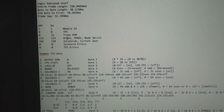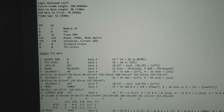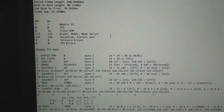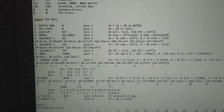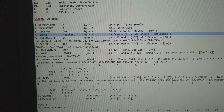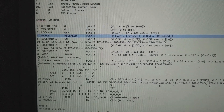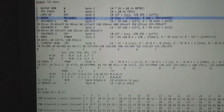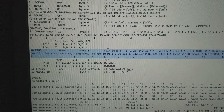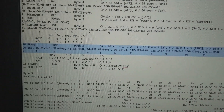For the brake switch: if the number is even, it equals pressed; if it's odd, it equals released. Not too bad. For the PRND switch, first we divide by 16. So 0 to 15 is a question mark, 16 to 31 is 1 or 2, 32 to 47 is 3, and so on. If we take 15 and divide by 16, that's not a full 1, so it rounds down and equals 0.